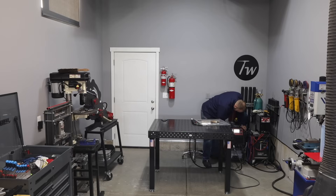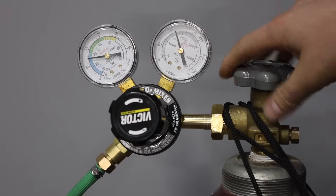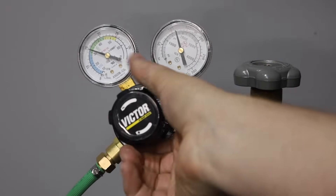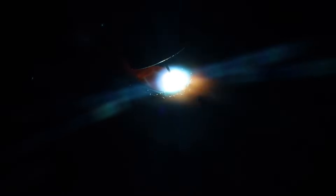So if you want to have the arc lit all the time, you just need to increase your voltage, change some settings a little bit, and change over to a shielding gas that is a lower percentage of CO2 or even a little bit of oxygen. That'll give you what's called spray transfer, where the arc is on all the time. This avoids those lack of fusion defects, but it puts so much heat into your material that it's really most useful on thicker sections and in the flat and horizontal welding position.